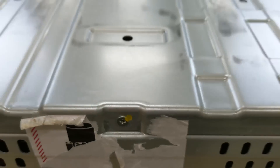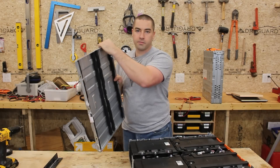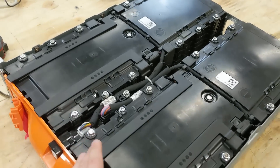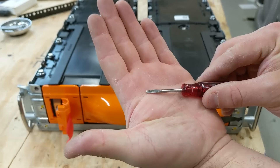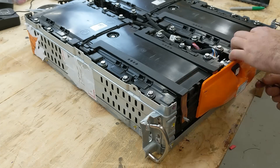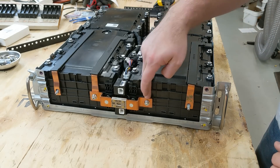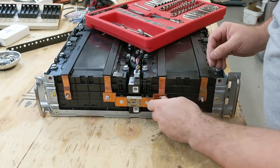So if there's a BMS inside it's not shut off, but I don't know exactly what's built into this so we're going to find out. We're going to take off all these Phillips head screws and get the top cover off. Inside the cover it looks like there is a bunch of open-cell padding. According to Battery Hookup's website, half of this is a 7S and half is a 7S, so if you wanted to use them as 24 volts that should be possible. I want to take off these orange covers. I'm going to take this 300-amp fuse off - these might be 10 millimeter. Yep, 10 millimeter.